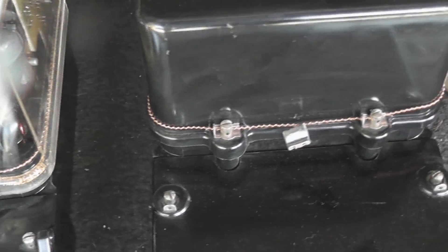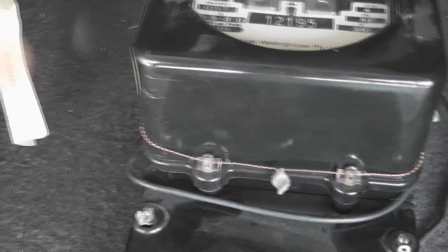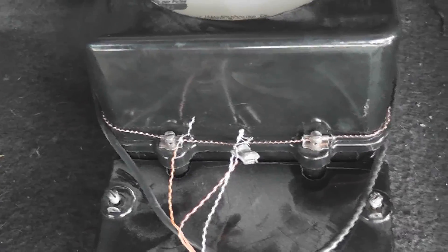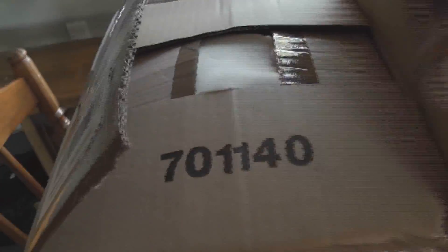Just to mention to Larry — these are the original email seals on the meter. I remember when we bought these meters in the early 90s; email always put a seal around all three terminal cover screws. These meters have never been touched after the manufacturer tested them. If that seal has been removed, the local power company would have probably done a calibration test.